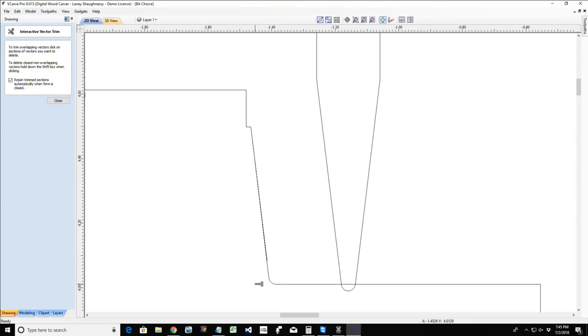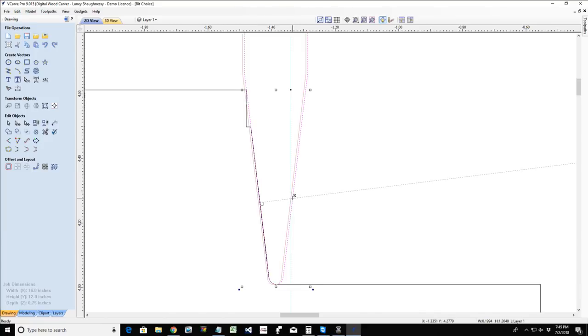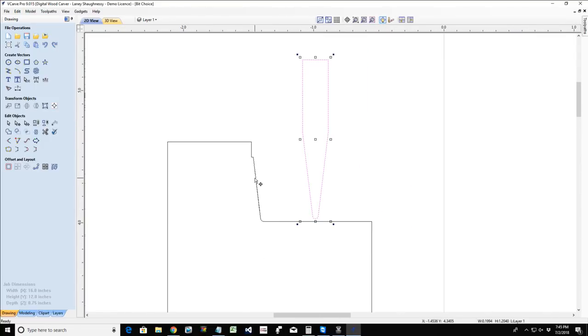So generally, you will see that there is a kind of a lip from that rough cut to the finished cut. There's generally a lip where the bit was cutting, that it comes right up to the edge of that cut, and that difference creates that lip cut. And so a tapered ball nose bit allows us to get deeper into those hills and valleys and eliminates the tool marks on the sidewalls of the cut.